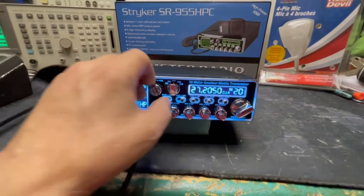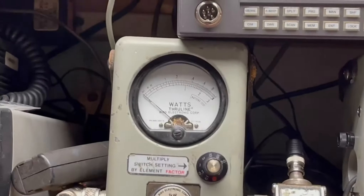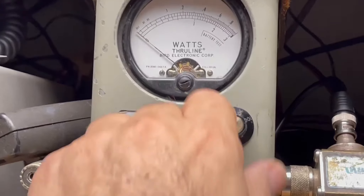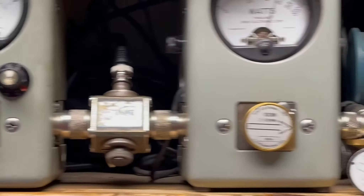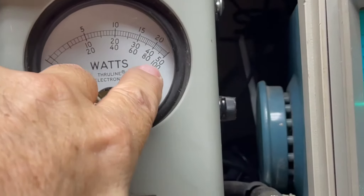Jack, we're going to have our power turned all the way down on AM mode. We'll take a look up here. This watt-meter's got 10 watts on the top scale there, so all the way down is 2. If I go to the next scale and turn the power all the way up, we get 20 — peak power on this 20-watt slug. Read it across the bottom here.